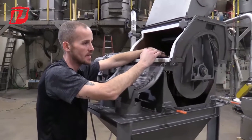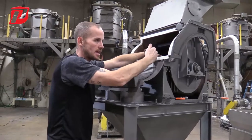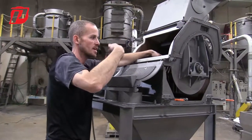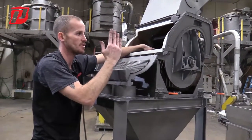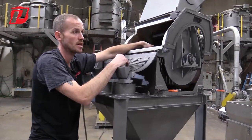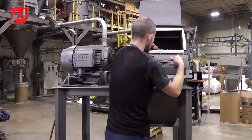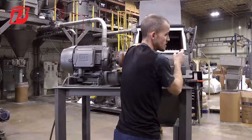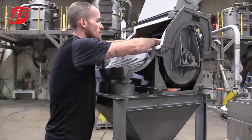Also, if you're seeing that, material could be getting in between the spacers and the pin. As the rotor is rotating and you have that force, it could be wearing that pin as well. So pay attention if you're starting to see hammers stick or material inside those spacers or hammers, because we don't want to damage those pins. Without addressing that, you might also start to see your spacers wear due to the friction and force when the rotor is spinning.